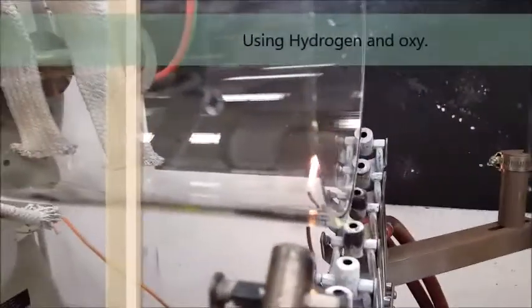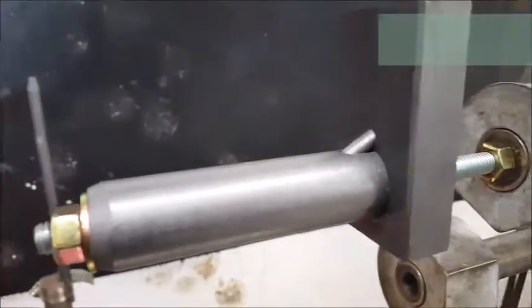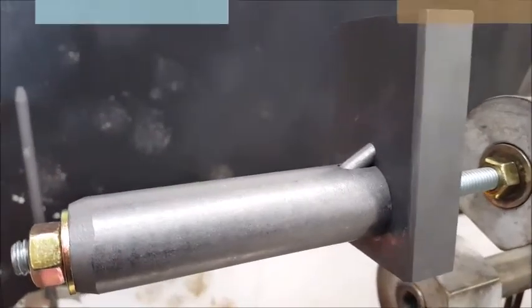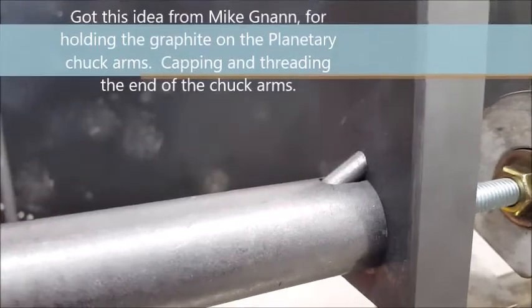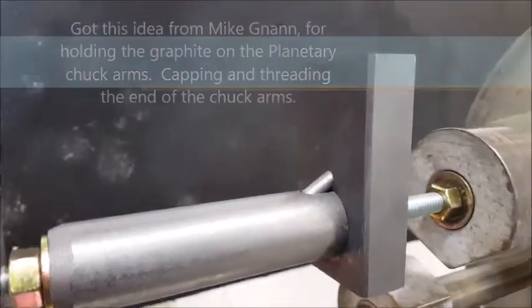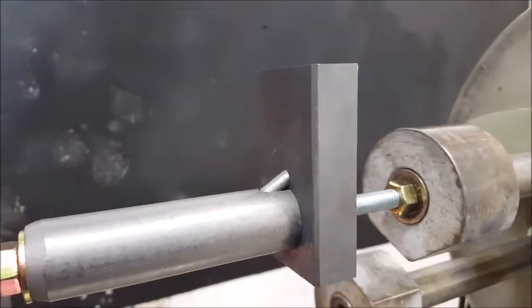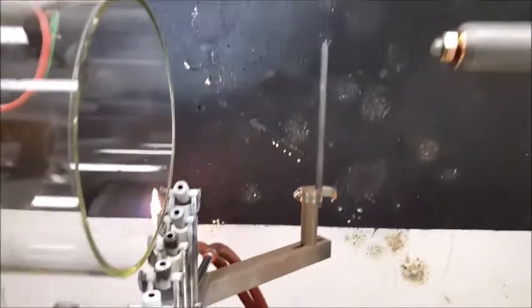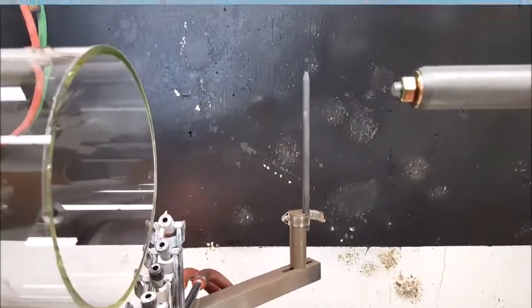It's 165mm tubing, it has a 175mm flange on it. This is my setup for the inside piece. It's a 30 degree angle, half inch length. And if you notice on the edge of the upright piece, it's beveled — to keep the glass from grabbing as it goes around. Let's go ahead and go for it.